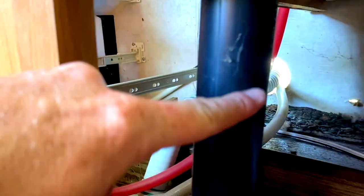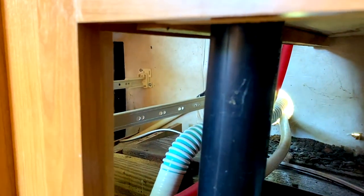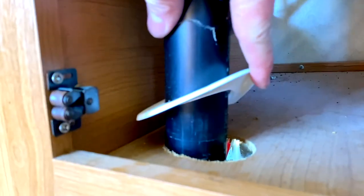So we can actually undo the supply lines. I need to figure out where those hook in exactly up there. This faucet needs to be replaced anyway — it's been broken off at some point, so that's part of the project as well. I need to figure out how to undo this portion to get it through here. I may just cut it right here and then use a coupler to put it back together when it comes time, so I can slide it down through there and get it back where it needs to go.